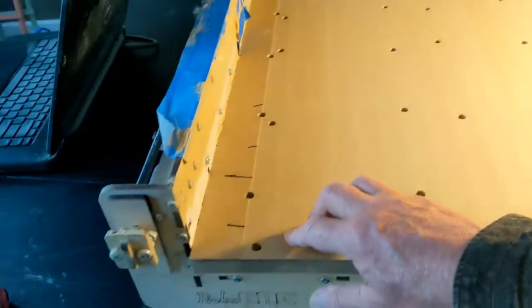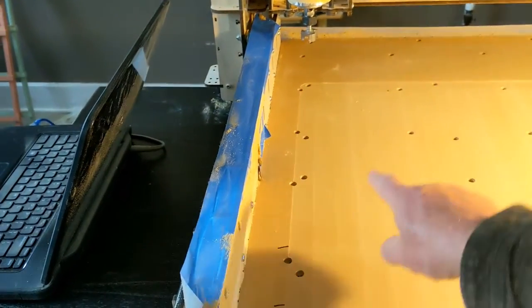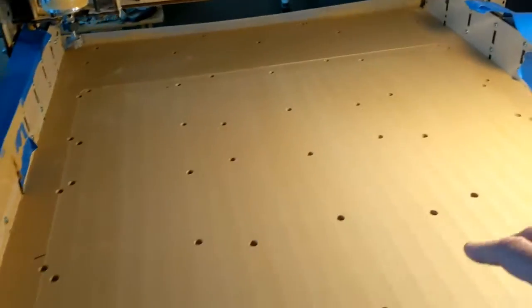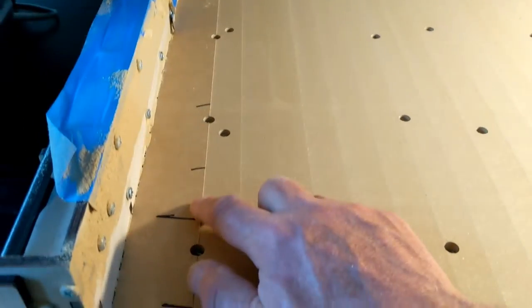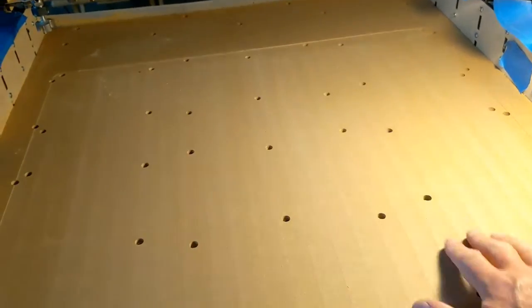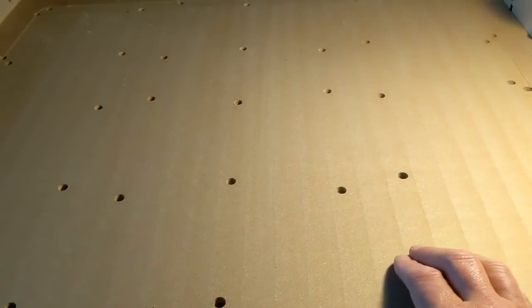So there we have it — this is the entire working surface. This line is at the home position, so I can actually use this as a reference point to set my boards on since I'm usually cutting 24 by 24. You can see there's a clear step there, all my marks are gone. I did a couple of overshoots there, and over here it's cleaned up. But you can feel a distinct height difference between the right and the left side, and you can see it back there. So now I've got a flat surface. You can see a little bit of mill mark, which means my head is a little bit out of tram — looks like it's out of tram that way, just by the feel of these grooves.